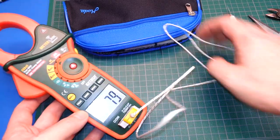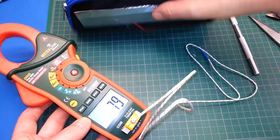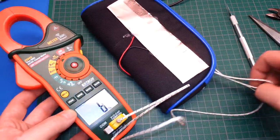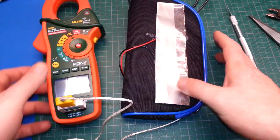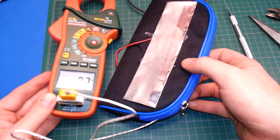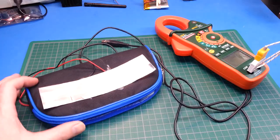Let's go ahead and stick the temperature probe in here. I'm going to use a contact probe on this. My infrared camera is not going to work the best in here, especially due to the emissivity of the shiny metal — I'd have to stick some black tape on it to get a decent reading. Let's stick this in here and let it go for a while and see whether we can get the temperature to come down. There's virtually no air movement in here whatsoever, so this thing is gonna struggle no matter what, but we'll give it a chance.